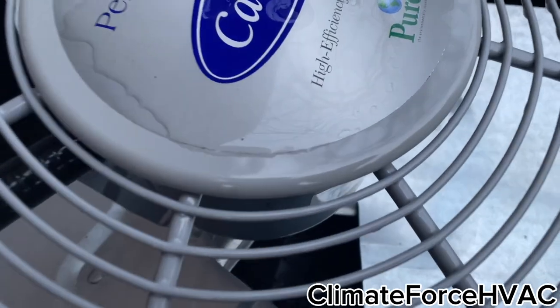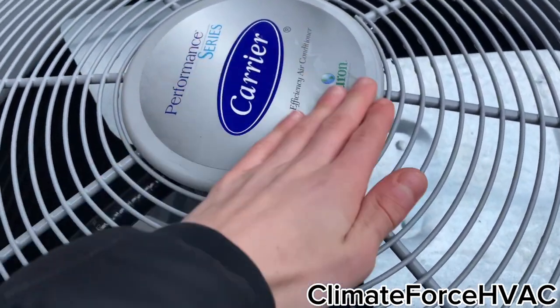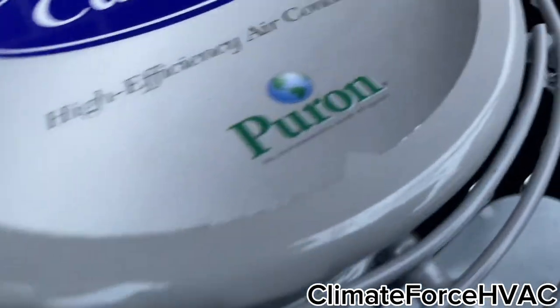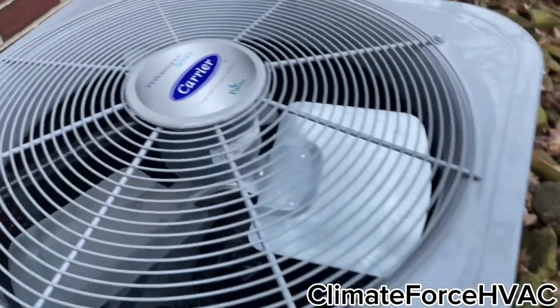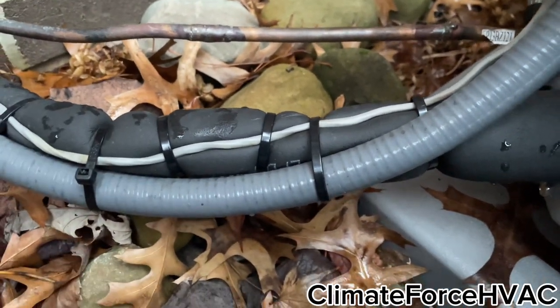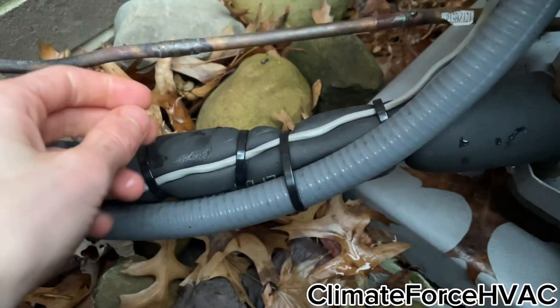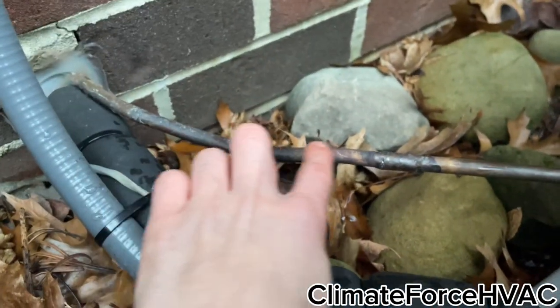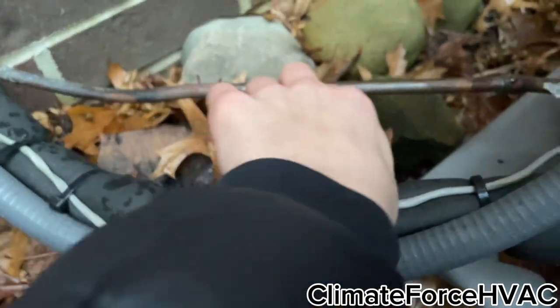I am planning on preserving this top logo — right now it's just wet. The performance label is not fading yet. Could have done a bit better on the brazing — it hasn't leaked yet, but the guy was holding the brazing rod by the very end. I mean, hey, it worked, but I'd prefer not right close to the joint. Right here you can get some leverage. You can see this is the new copper, and this is the existing copper right here — up until this joint, then it goes straight to the unit.